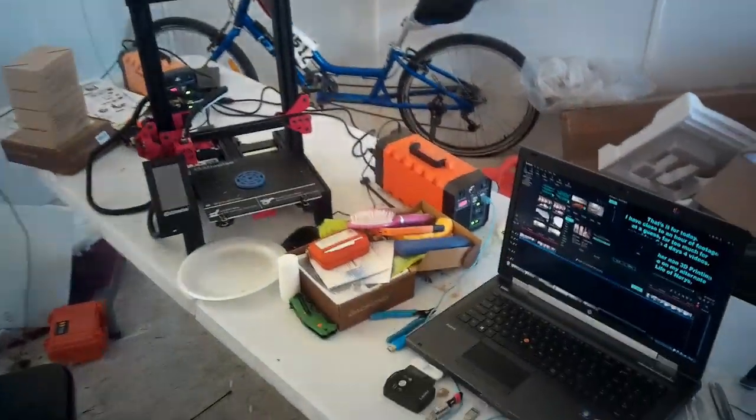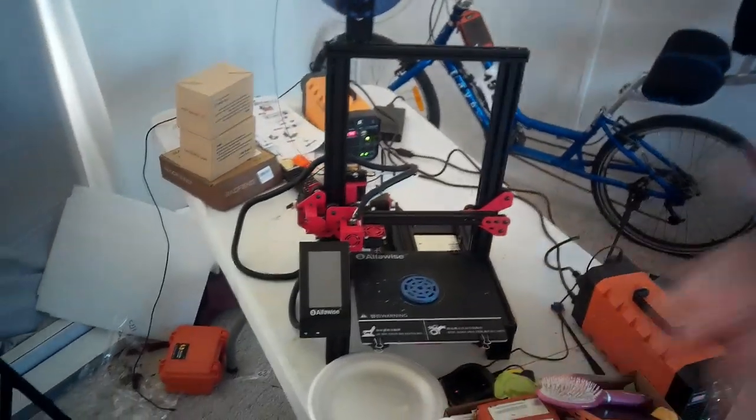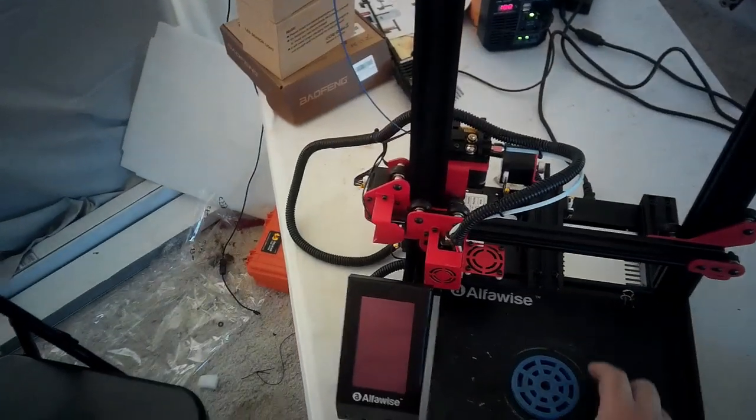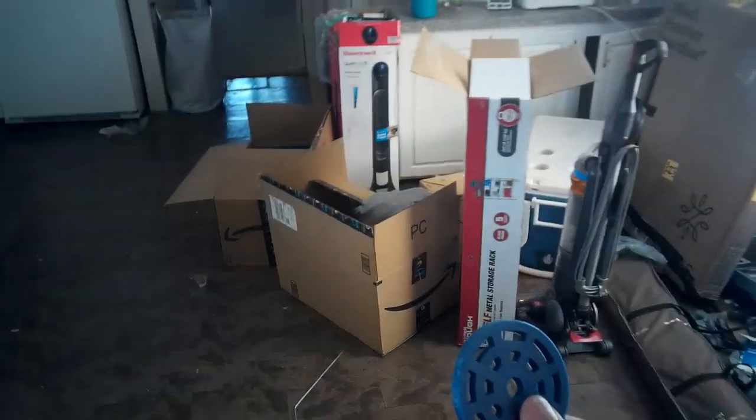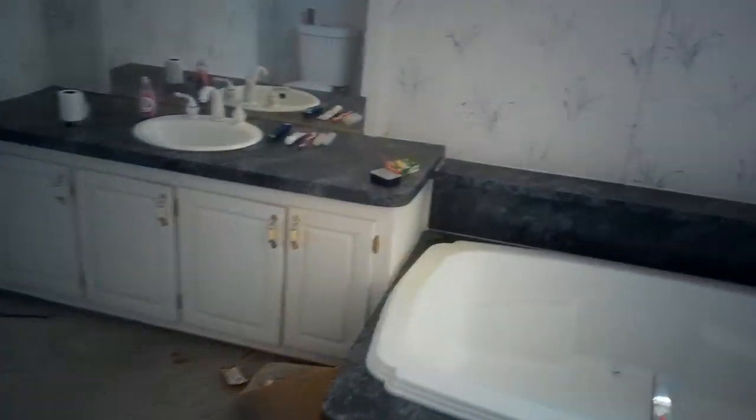So, as you guys know, I needed a new one of these. So, AlphaWise U30 to the rescue. Here's the print. It took 20, 25 minutes in Tinkercad to make this. About 2 hours to print it. I kind of went overkill. 4 perimeters, 4 top, 4 bottom, 25% infill. It's PLA, but it's 7 millimeters thick. So it's plenty strong enough.